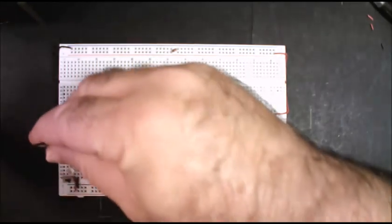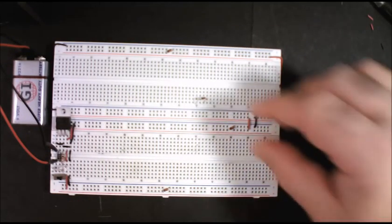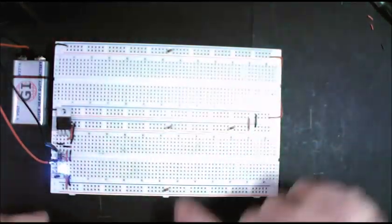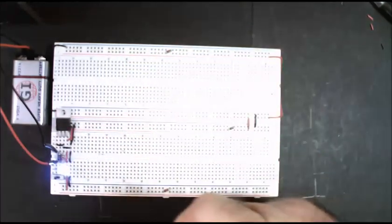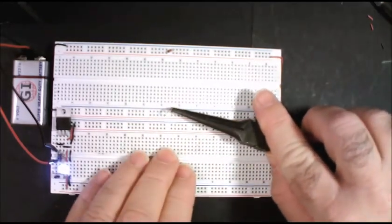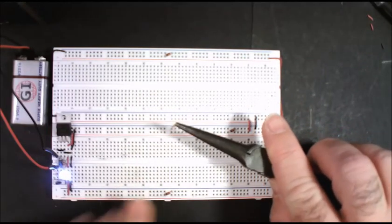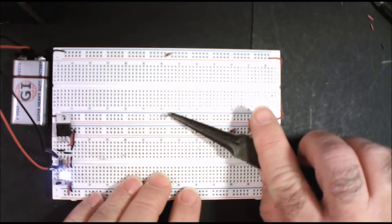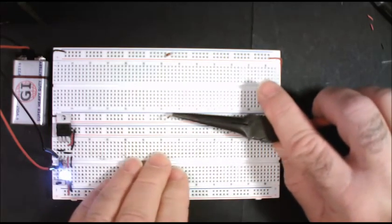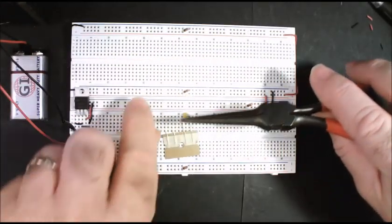Now we're going to hook up our battery. Let's first turn this on with the Zener in the correct direction. You can see that's working. Now I'm going to use pliers because it's going to get hot pretty quickly. So if you put this in backwards, watch what happens — your light goes out. If your light doesn't work, check your Zeners first. Make sure you have them wired up correctly. Then check your buses to make sure you have the jumpers wired correctly. Do not work with power on — I'm doing this just to demo.